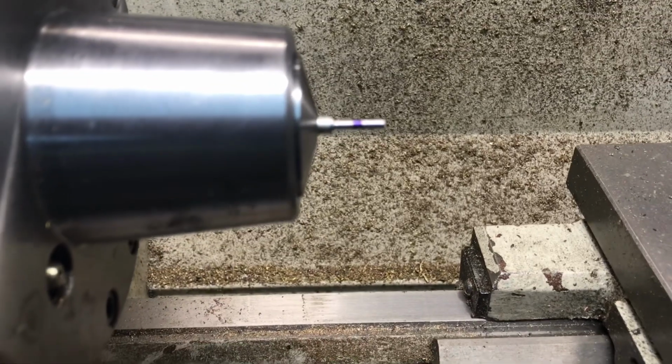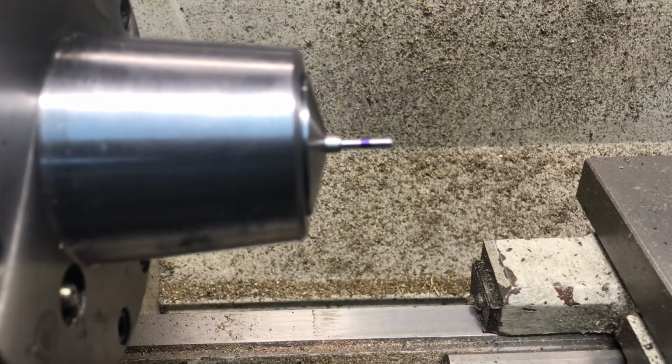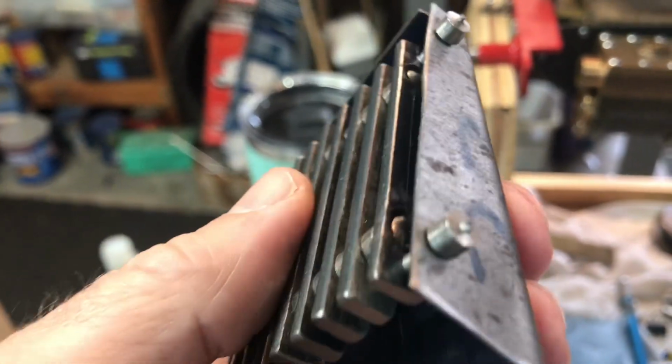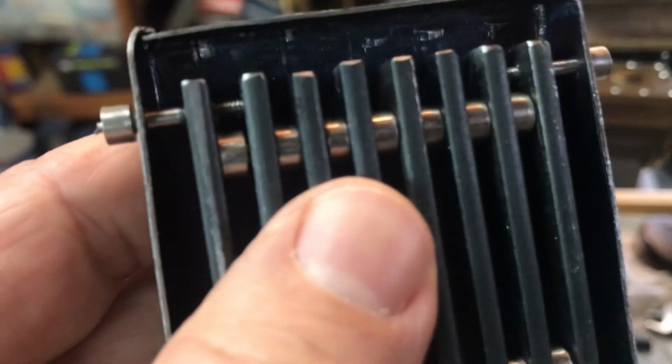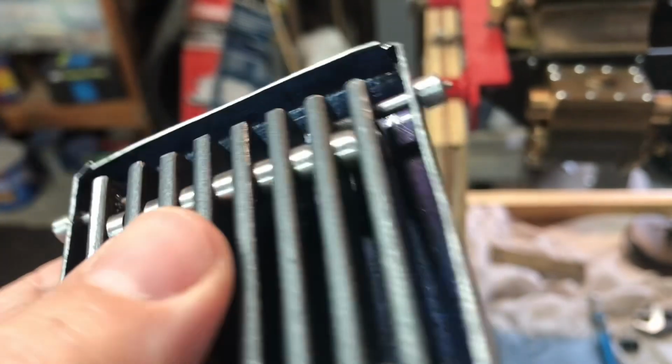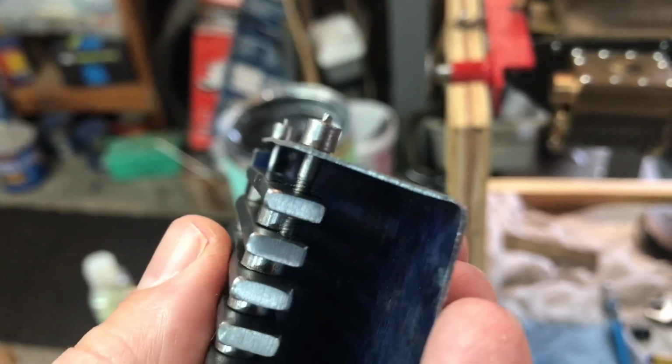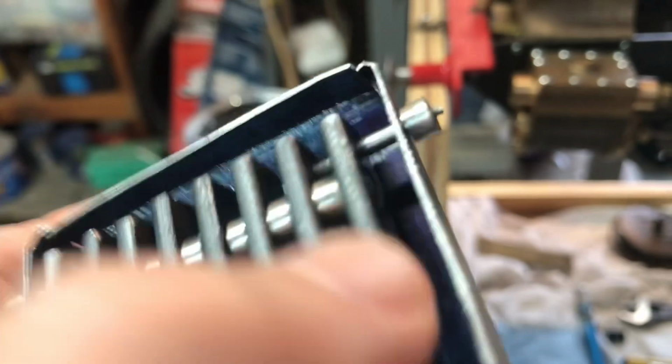So these are a little larger than those that are called for in the book. And here's the ash pan and grate with the little custom-made stainless screws in it. I do need to take these back out. I was just test fitting them. I'll put them into the lathe, clean the heads off, just face them off, and then I can put a screwdriver slot in each of them, and we'll be good to go.